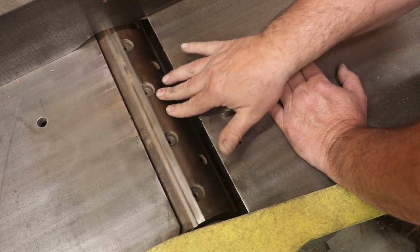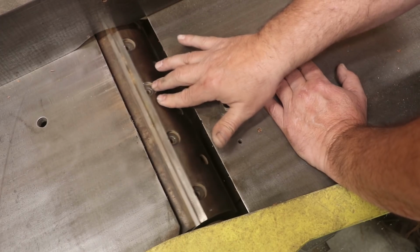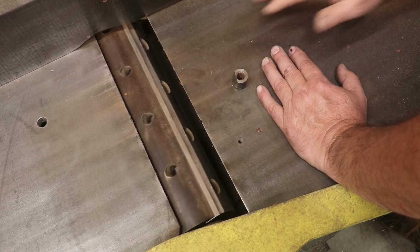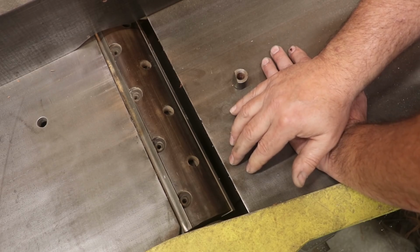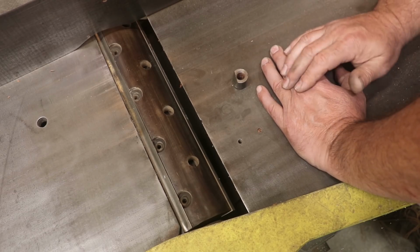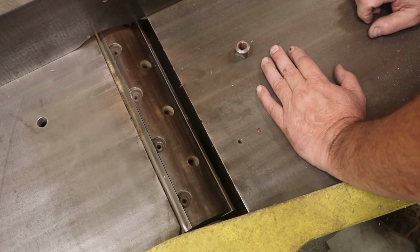This particular cutter head here's got 4 sets of knives on it, and 4 key plugs per knife, depending on the width of your jointer or your planer. The number that you need varies. Like I said, this is a 16-inch machine, and some machines, particularly like a 24-inch planer, are going to be much wider. A 12-inch jointer probably would only have three key plugs in it, etc.